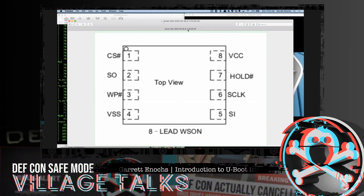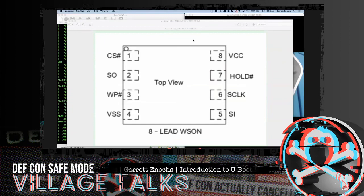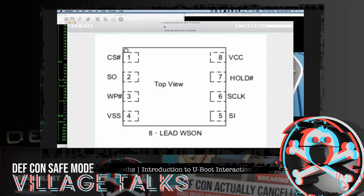That's why it's very important to... I'm not against using a resistor. I mean, there is some value to that. You'd have to experiment around because obviously you want to interrupt the data significantly enough, and a resistor may or may not drop the voltage enough based on the resistor size.